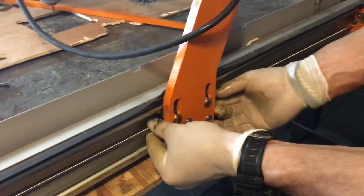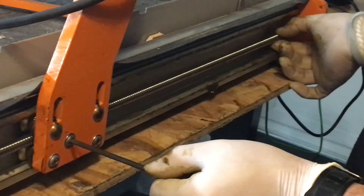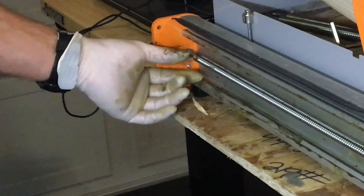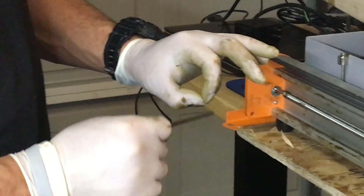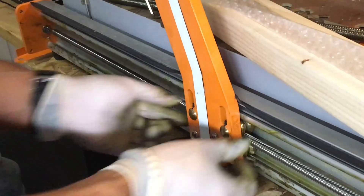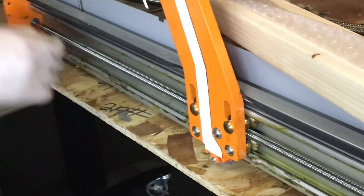As you can see the middle of it's right here, so this needs to be adjusted. You need to adjust it from the middle right here. Same thing on this side — you want to make sure when you tighten up a little bit you're gonna have play. Make sure that you're right in the center of the diameter of the bearing. You want to make sure that the rod's play is perfectly even, so when you push it it meets the outside. If you notice that it'll go to the center and it'll go back down, you need to adjust this part right here, whether up or down. It's recommended to adjust it from here, not here. I'm gonna bring it back just a tiny bit. That looks just about right — I'm going to tighten it right there and push it in.